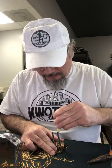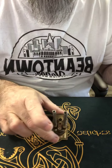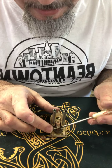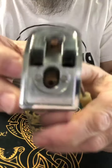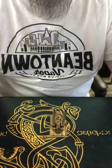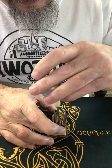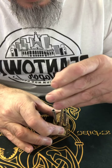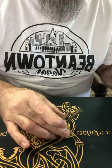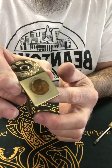And the other thing is the alignment. So, let's see if you can come down here a little. If you can see what I'm doing. So you want to make sure that these two magnets are even, parallel, so that when they come on that, you know, those magnets are pushing. So you tuck it all the way up, make sure it's even. You do want to kind of tighten this one a little bit more than normal, but don't go crazy. So it should swing like this, freely.